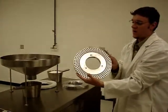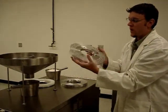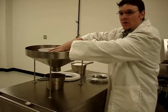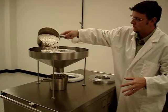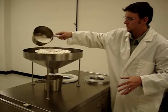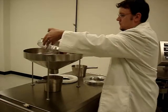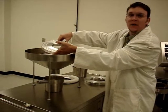Here we have a capsule insertion ring — it has a shutter and a trigger. We use this hopper and recovery pan to do a flood fill process. The product that is going to be inserted is the size four capsule. This is the flood fill. Here we have our size four capsules flood filled into the insertion ring.